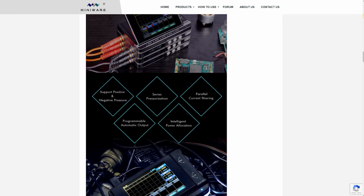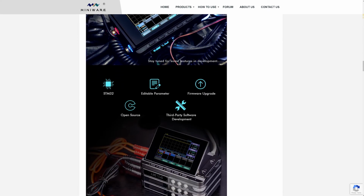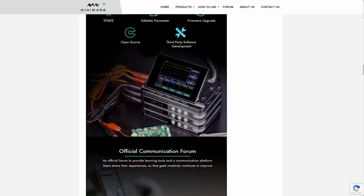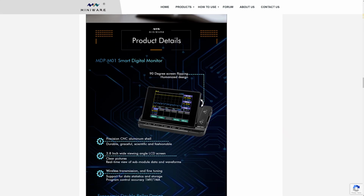Support positive and negative voltage? Well, you can flip the leads, I guess, but you can't program negative output voltages. That's going to be an OSMU exclusive. Series connection? Not effortlessly. The in and outputs are not isolated, so if you want to connect multiple power modules in series to reach a higher output voltage, then you have to keep their supplies isolated. For example, one big LiPo battery or power bank per slice.